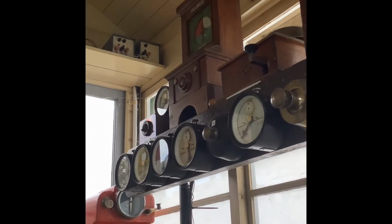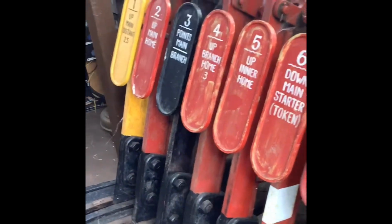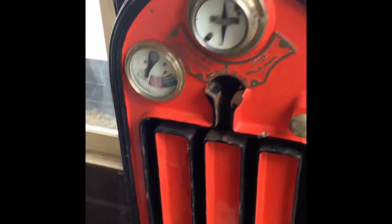So contact boxes on the back. Most of them have economisers off the catch handle, apart from two up here that are on the levers, on the plungers. The gravity locks are all squeezed in, and there's circuit controllers under the floor, along with all the dirt and mud. Compact and bijou, yet still a lot of space.